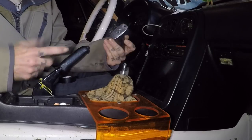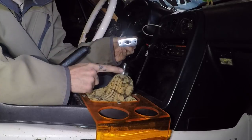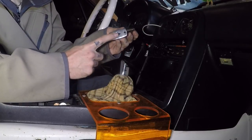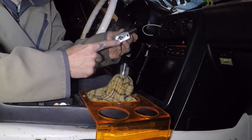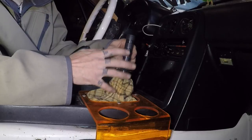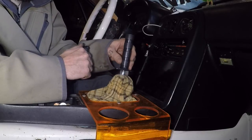All shined up nice and bright. I can paint it, I can leave it — whatever. If you intend to tap this to thread onto here, you need to drill this a half size, maybe one size smaller, and then tap your threads into it so it screws on. I did it a little bit bigger so it slides right on and off.